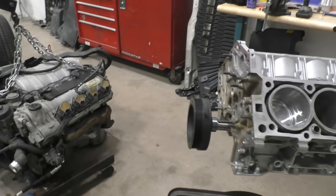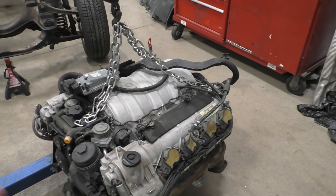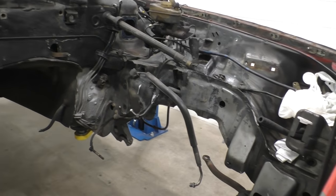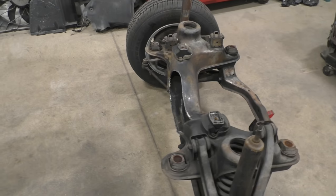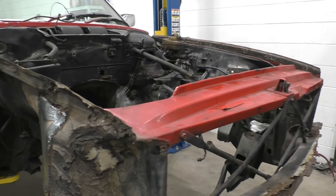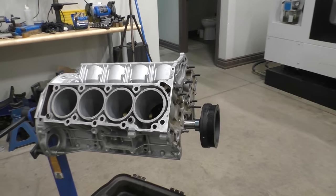Before that, you guys are going to see another engine — an AMG M156 engine from a C63, the 6.2-liter Mercedes V8, going into the Mercedes SL. We were doing quite a bit of work trying to make it fit in that car, which was not as easy as expected — quite a lot of cutting and welding needs to be done in the engine bay to make it bigger and clear everything, and also on the subframe to make the engine fit. Hopefully in the next video you'll see more work on that car and get it running soon. There's quite a lot of cool stuff coming up, so definitely stay tuned.